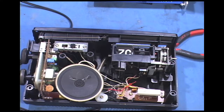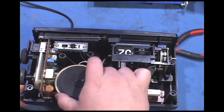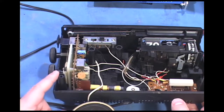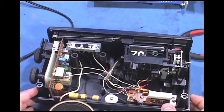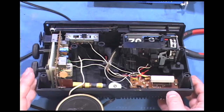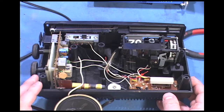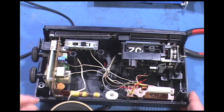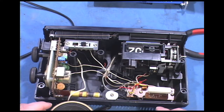I'm going to let it dry. I then have to mix up the epoxy to repair the speaker mount. I may not replace the capacitors in here because right now everything seems okay, and this board is mounted to the tuning assembly — I would have to unstring it and it's really not worth it on something like this. Tuning dial strings are always a bit of a pain. I didn't hear any hum. I still have to clean the potentiometer and the switch here.